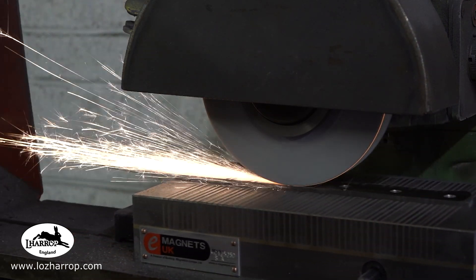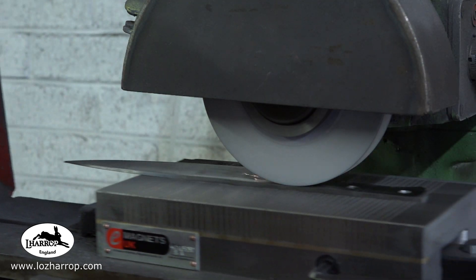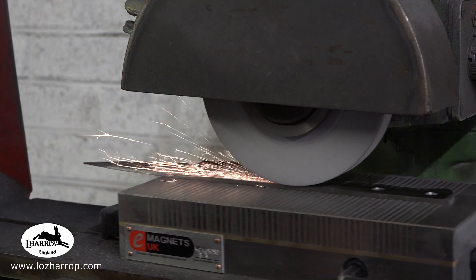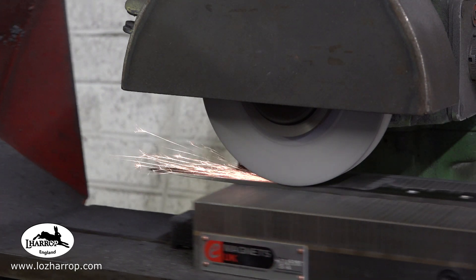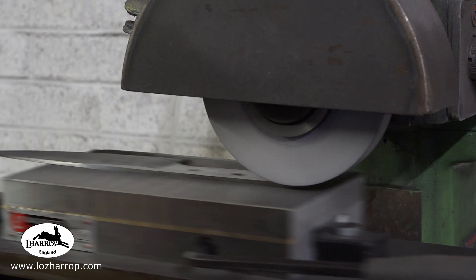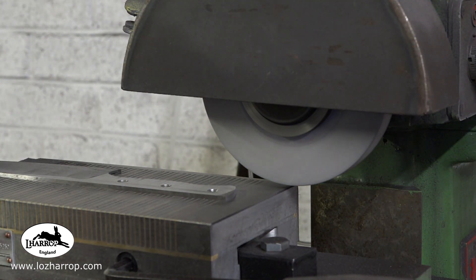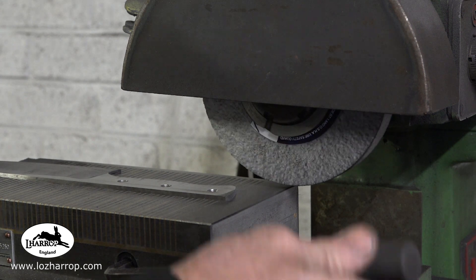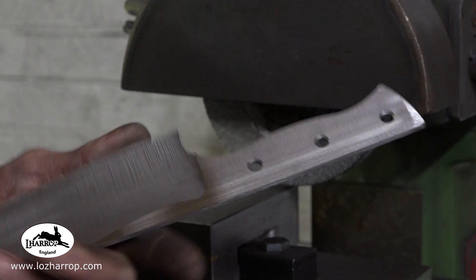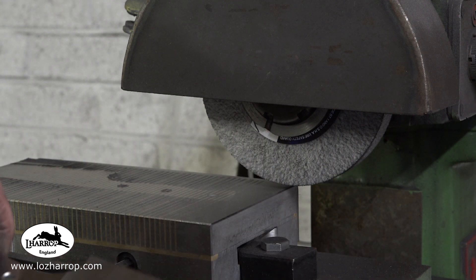So I've come on to Herbert to clean up the handle prior to quench — he'll also get everything beautiful and flat. I'll probably run it over again after heat treating; it gives you a lovely finish. So I'm going to degrease this now and get some anti-scale on.